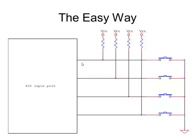It's a pretty simple, nice, easy interface. But what if you have a lot of buttons? You could use a lot of port bits, but a microcontroller doesn't have that many and we're usually using them for other things. Think about a keyboard on a PC — it has over a hundred buttons. You wouldn't want to use a hundred port bits. Simple is not necessarily elegant or efficient. If this job were simple, anybody could do it — and if anybody can do it, you make minimum wage. Deal with the complication and that's where you get the good-paying job.